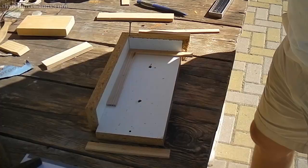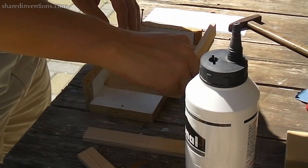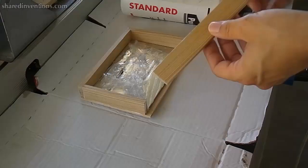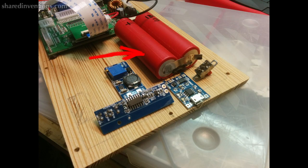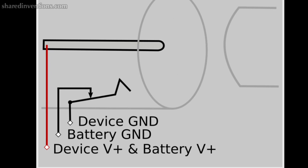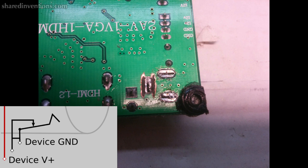I used a right angle jig when gluing the pieces together. This is going to be the front frame and the sides. I placed the actual screen in the frame when gluing the last pieces — of course the screen was well wrapped. I wanted the unit to work from both an external adapter and from internal batteries. For this I needed to modify the DC plug so that it cuts the internal power when a plug is connected.